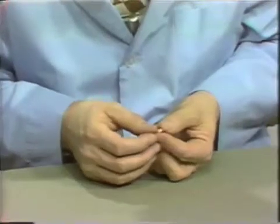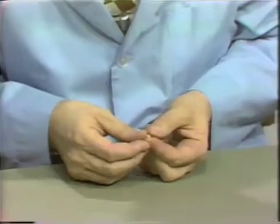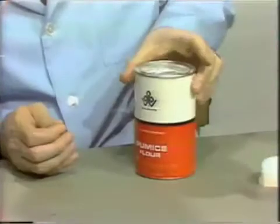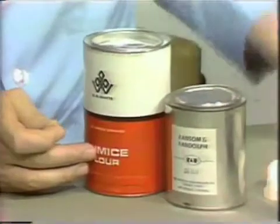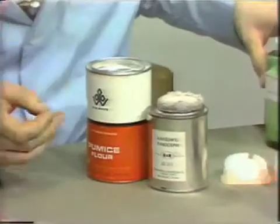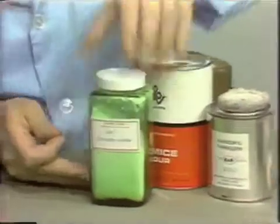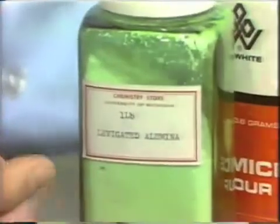When this is polished as highly as you can get it with a rubber wheel, then we are ready to go to the rag wheels and the polishing materials on a lathe. There are two stages in polishing the facing on a lathe. The first stage is using a material such as fine pumice or Triple-X Silex with a regular rag wheel. The second stage, after polishing as highly as you can with that material, is to use levigated alumina, which is used for grinding and polishing lenses, and with this material we will use a different kind of wheel.